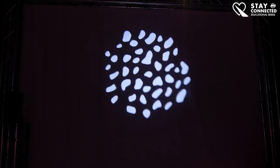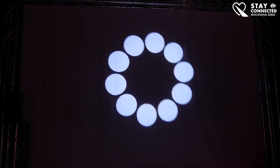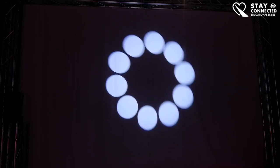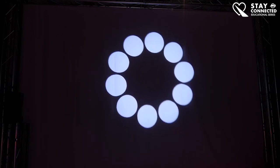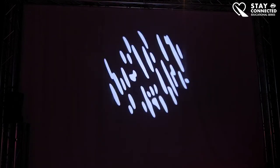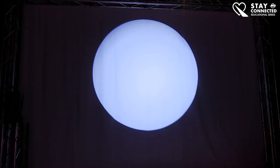Next we have a pinwheel effect and more texture breakups — that's all the gobos on the 4Z. After that you get into gobo shake, which you can shake either slow or fast and it gets pretty fast. I use the gobo shake feature quite a lot in beam units because applying a color on top makes it bounce back and forth between each color. For spot or wash units I don't use gobo shake as much, but you can use it on a very slow shake with a prism effect and add an added layer of intensity.